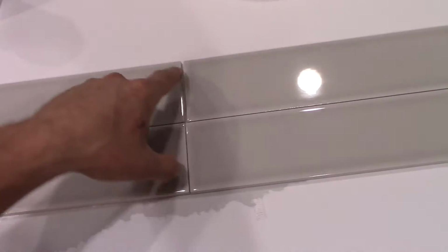And this is the brick pattern that I was talking about. So you'll have another tile that's going to come back, and it's just going to be an alternating brick on thirds. I'll show you. This would be just what they considered a grid pattern. The grout joints line up. I'm using 1/8 inch tile spacers.